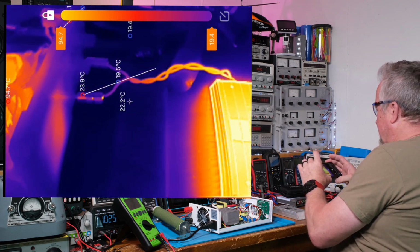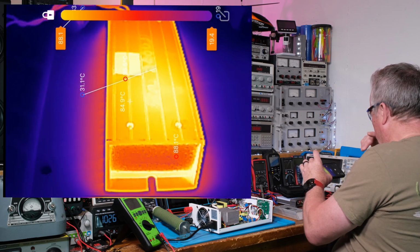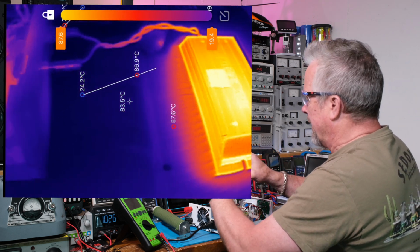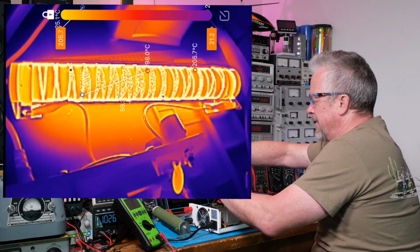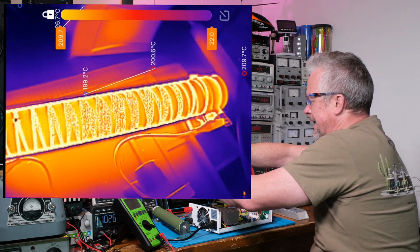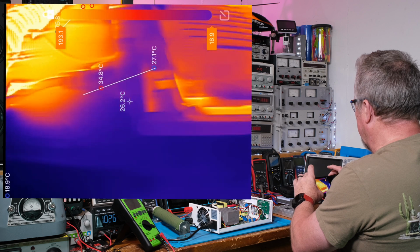So we're running this load out here, and it is getting pretty darn hot. I can smell these things, of course. These things are really hot. About 100 watts on this side, and about 200 watts on this 300 watt resistor. Pretty cool resistor, right? It's a non-inductive resistor. It's counter wound to counter the inductance. This thing actually works better as a non-inductive resistor than this one.